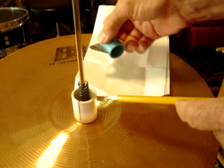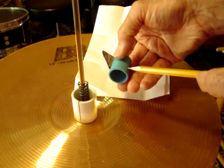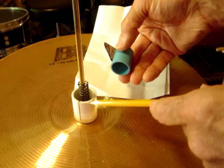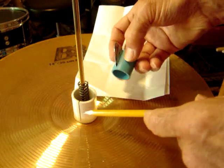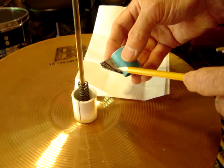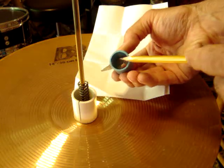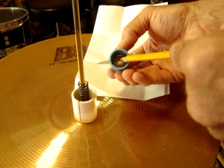The last important section is the inner sleeve, cut from a smaller section of tubing that fits loosely inside the outer sleeve. This groove cut for the flag is where this flag will pass through. The flag is mounted so that the inside of this tube is clear and the spring will fit inside of here.